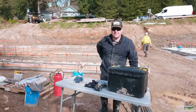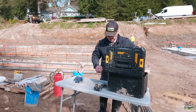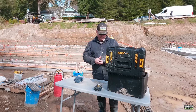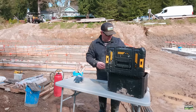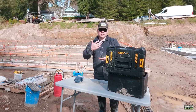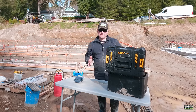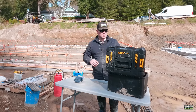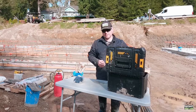Okay, so that didn't go well. Could have gone a lot worse, a whole lot worse. But basically, we've been dealing with hot mud from the batch plant. And by we, I mean everybody in the area. And then we have 1x4s across the top of the footings because that's what we put our 2x4 and then we put our verts to. So wherever I had a spreader cleat next to that, I was like, well, I'll just take them off now instead of tomorrow after the concrete's on, you know, covered it. The one I popped, the 2 1x4s next to it were not nailed.